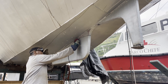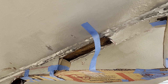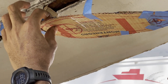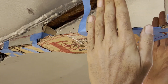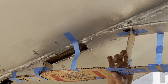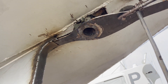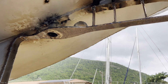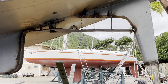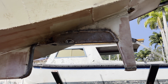To fit the new motor and the folding propeller, we had to increase the opening at the skeg to 80 centimeters from the original 50. We used the measurements provided online to create our cardboard template, since at this point we still hadn't received the motor. The goal was to create only one hole in the hull below the waterline — the one that the wires passed through to the controller. We put in an 8-millimeter steel plate for the motor to be attached to and where the actual bolts would be fastened. We then started to cut out the pieces and weld everything together. A stainless steel tube was installed to pass the cables through to the controller, and vertical supports were placed to reinforce the structure. Finally, the frame was sealed off and welded shut.